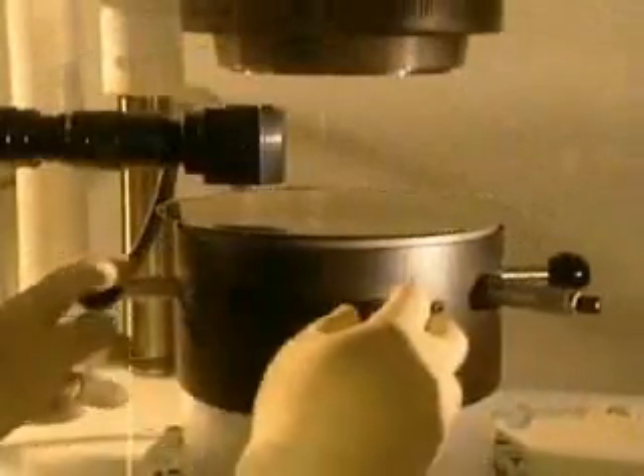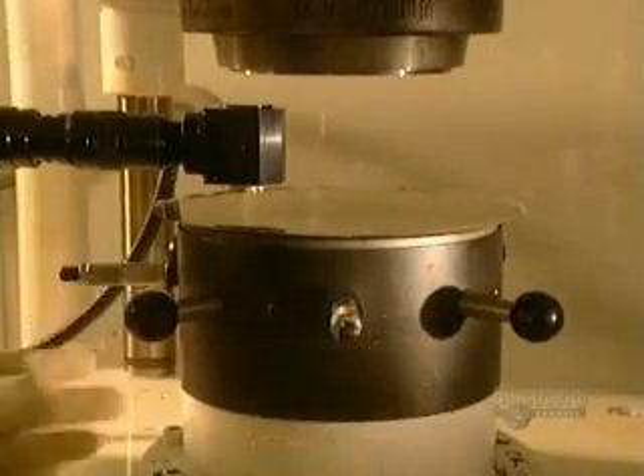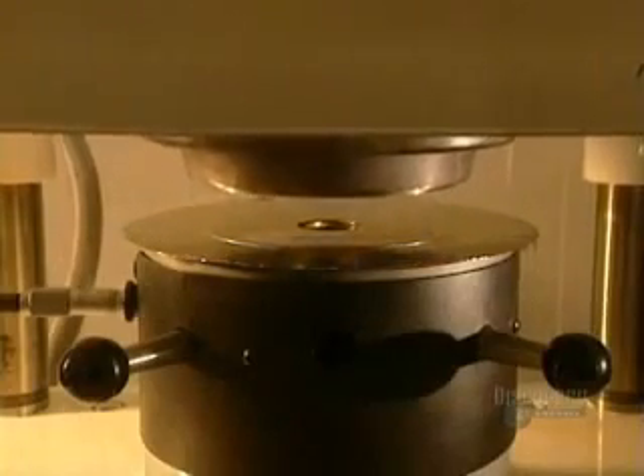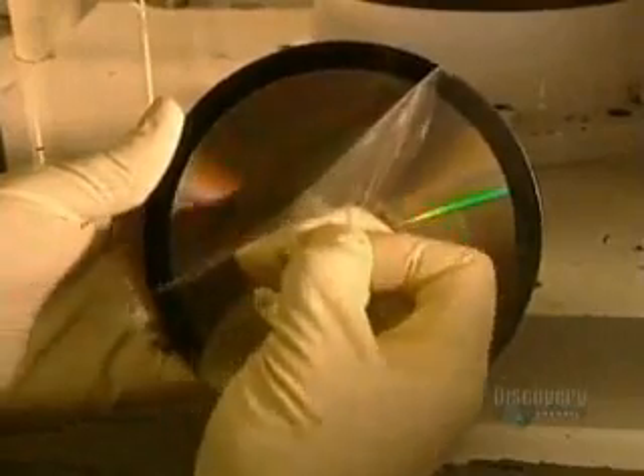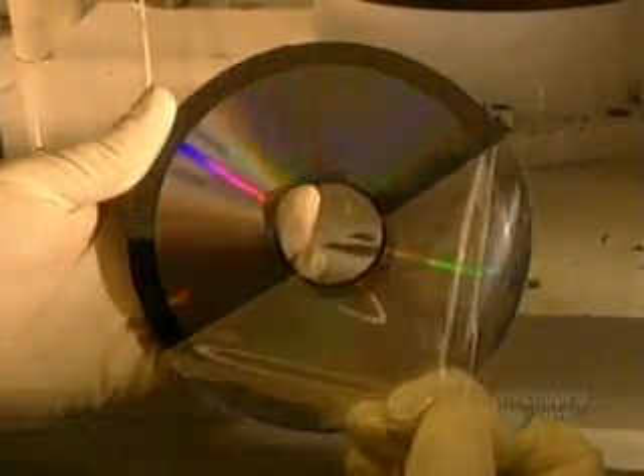This die is sent off for finishing. It is stamped out into the desired shape. The excess material is later recuperated for recycling. Following on, the compact discs will be fabricated from this master unit. Here we clearly see the stamping out technique. The master is taken out. A technician peels off the film which protected the data etched onto the die.